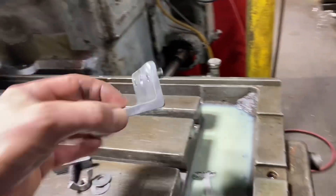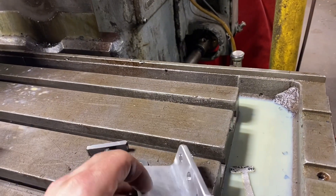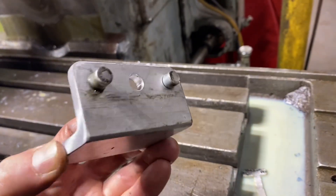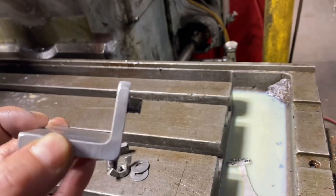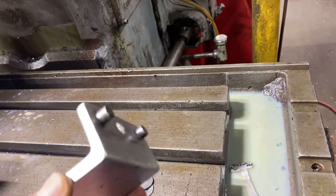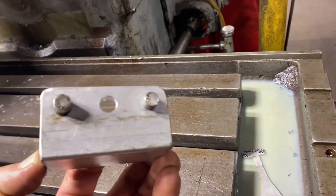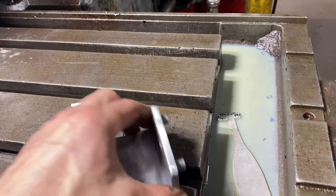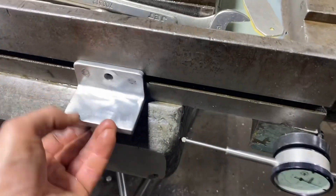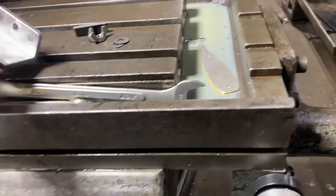So I took a piece of aluminum angle — it doesn't have to be aluminum, but that's what I decided to use. It's got a three-eighths clearance hole and then two three-eighths national coarse tapped holes. I wound some bolts into it, cut the bolts off, staked them, and cut the other part of the bolt off. Now this sits in this slot here quite handily with not too much play.